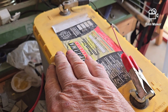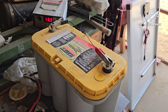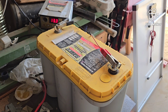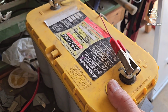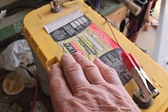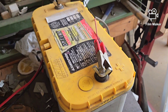This controller is only for lead acid type batteries. Now if you want to use LiFePO4, I want to explain the difference between LiFePO4 and lithium ion. Lithium ion is different from LiFePO4, which stands for lithium iron phosphate. These are completely different battery chemistries. A lead acid battery probably weighs 40 to 50 pounds, which is really heavy, so it's not ideal for a portable camping unit. For that you want to go with LiFePO4, which is designed to be a lightweight battery and still give you plenty of power.